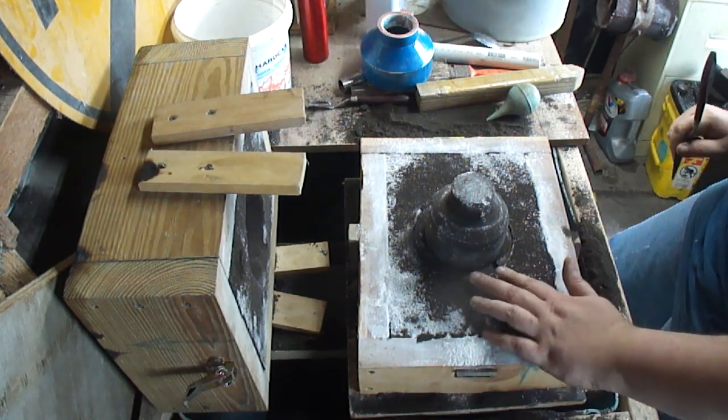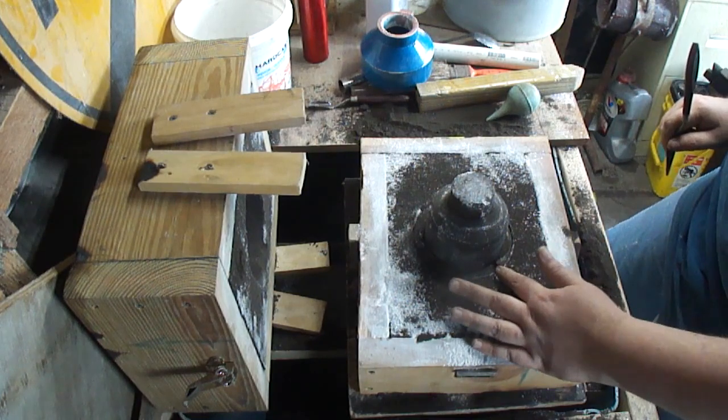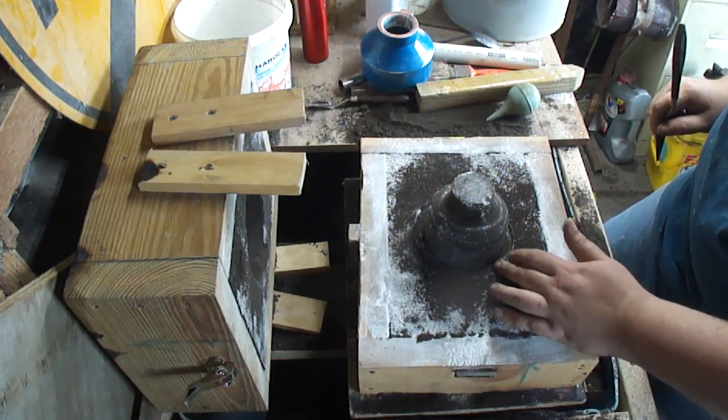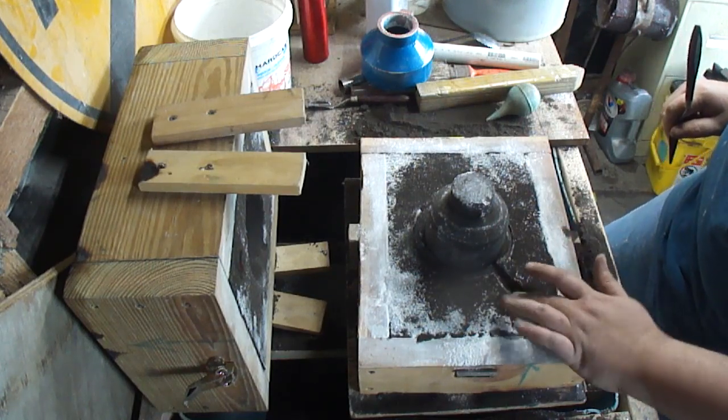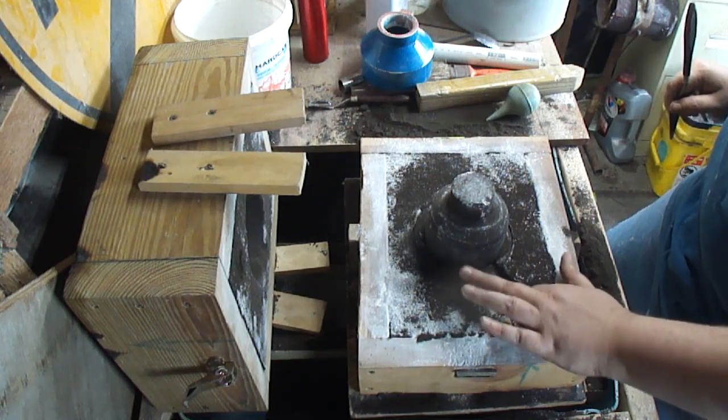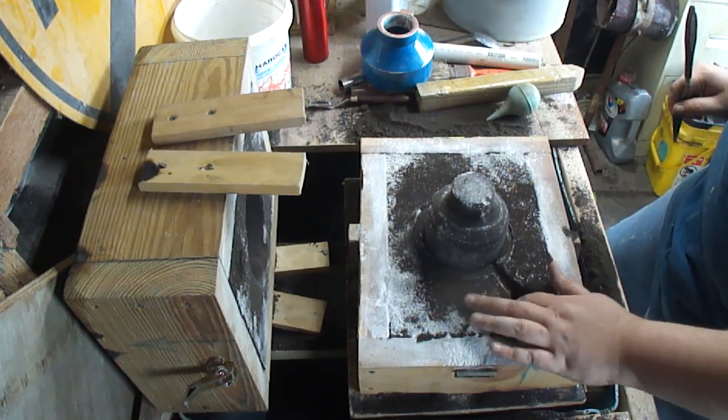I had a little bit bigger trough this time, or bigger runner this time, because that choked a little too hard last time and I wasn't sure it was going to fill. And this crucible is heavy, I'd rather not be standing here holding it.